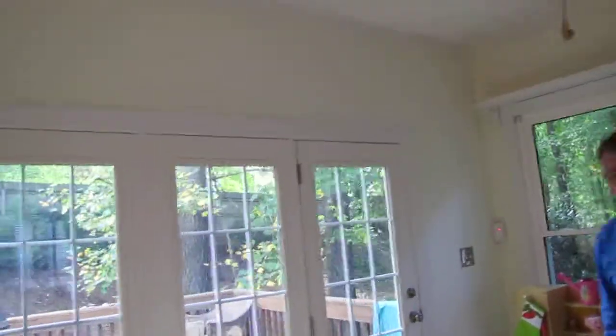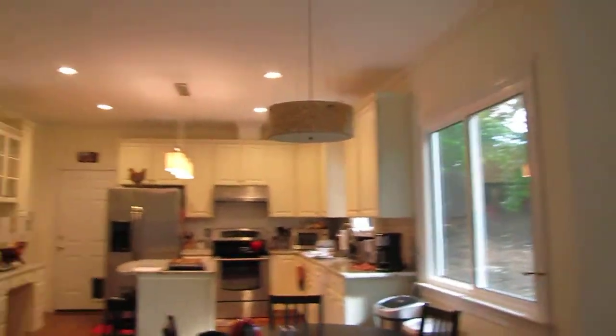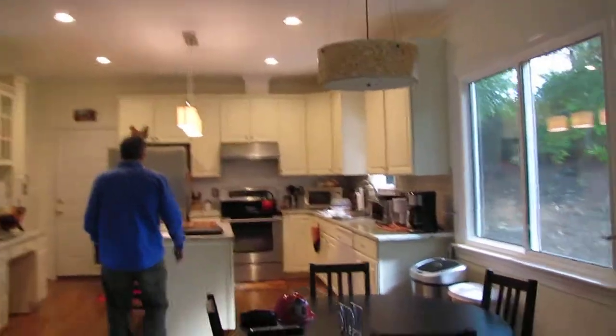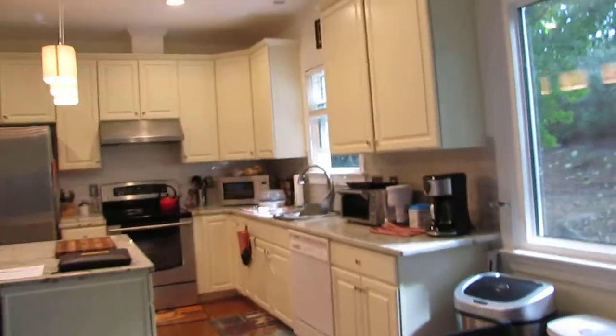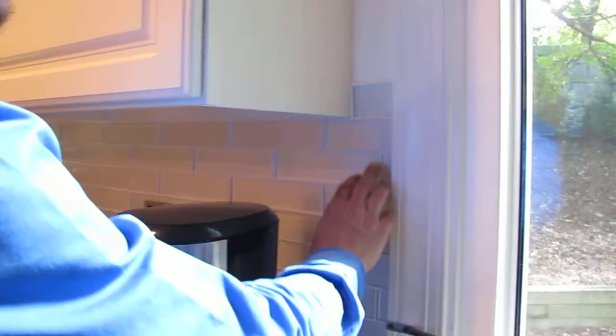It looks great. I've talked to Stephen and he is singing your praises yet again. This is an amazing kitchen, and the detail in it — the subway tile — everybody's going to the subway tile now. But the detail here, getting this little piece to start it and then maintaining the same row — it's all 1/16th-inch gapping, and the variation of the glass makes that tough.